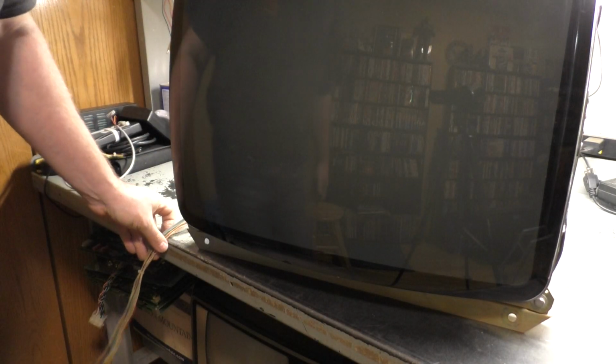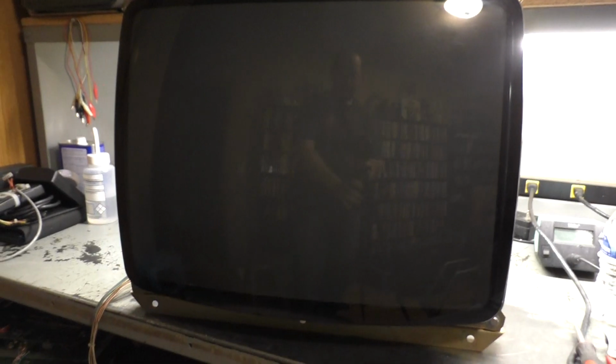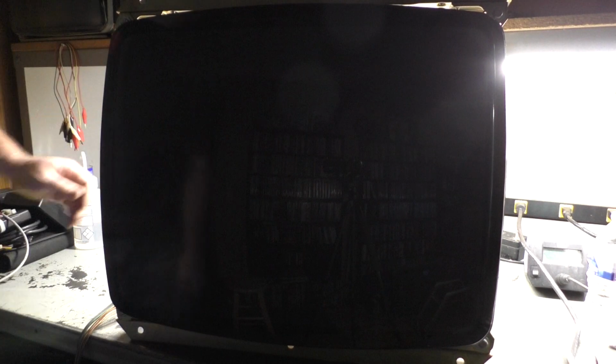And I got a WWF WrestleMania PCB up there hooked up, so let's just go for broke and turn our light off and hook up our video cable and power. And one of these K7000 that I had a cold solder joint causing vertical deflection problems. I hope it's not this one. I got a stack of them in a storage downstairs, so I hope that's not this one. But anyway, okay, here we go. Let's see what happens. 1, 2, 3.